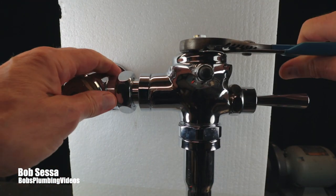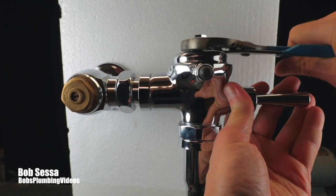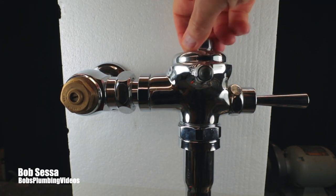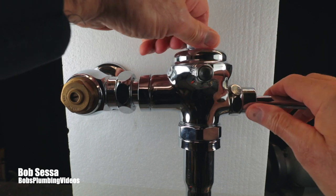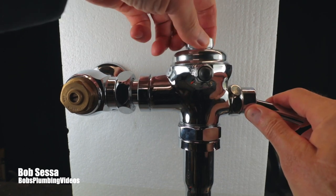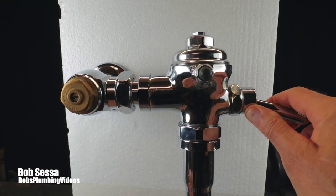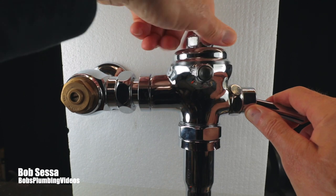I've gotten myself into quite a jam before - if these don't shut off, I immediately go to the superintendent and say you have to shut this line down, because I'm not pulling this apart unless we get a hundred percent shutoff. To remove the head, use a spud wrench with no teeth, or channel-lock pliers with no teeth, to keep from marking up the chrome. Simply take the head off - keep the handle down to drain the water out. Put a bucket and towel on the floor.